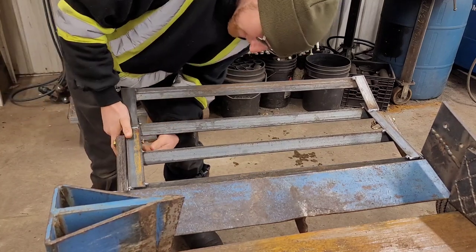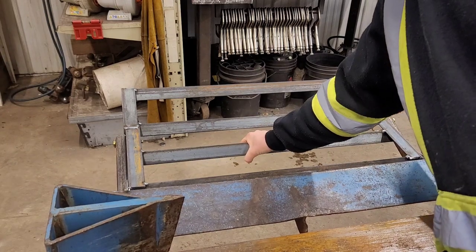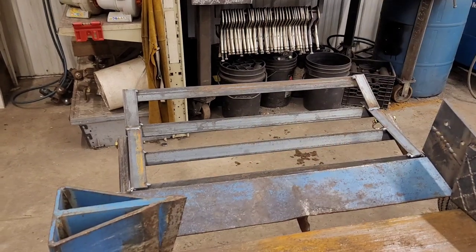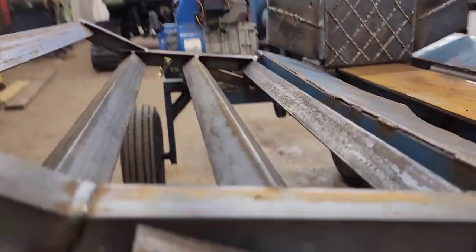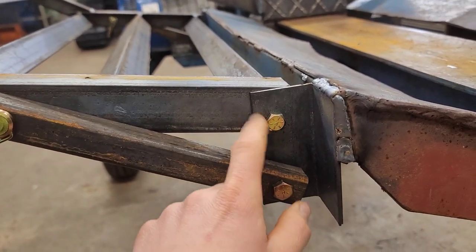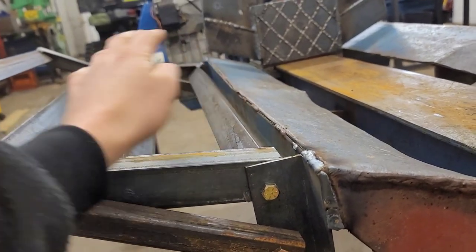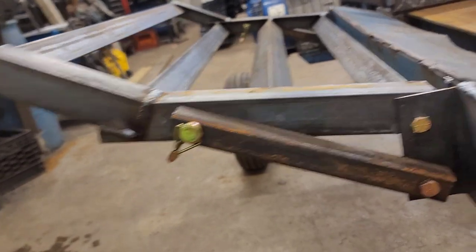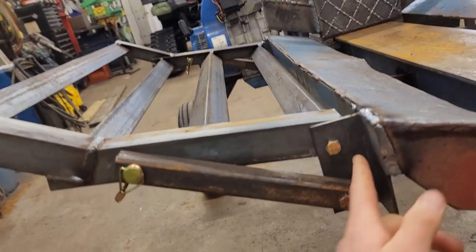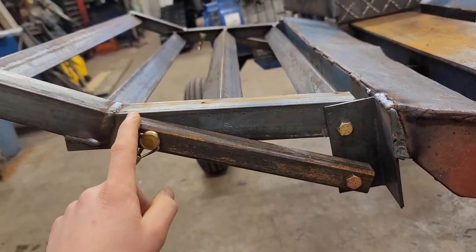There we go. Not perfect, but it should work. And I mean, we were jumping on it. We were banging around on it. I mean, it's literally just, actually, maybe I'll show you guys here. So it is pretty simple. 3/8 bolt for the hinge point, 1/8 inch and a half angle iron, 1x1 square tube, 2-inch angle iron. So that's just your brace, holds it up.